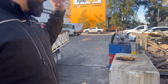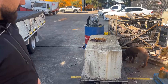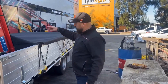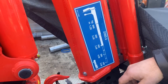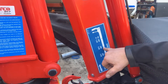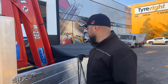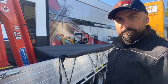Over here you can see we've got a big dead weight — it is a concrete block and it weighs 940, 920 kilos without the chain. You can see on the lift indicator we've got 990 kilos rated capacity. So we'll lift it and extend it out a little bit more. At about there we should be almost at our full capacity, which should light up on our screen here. I'll go through the pack up, the setup, and then the use of the crane now.